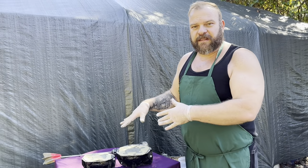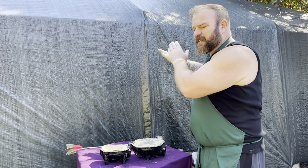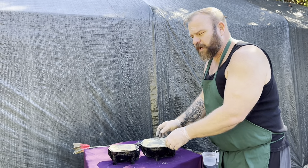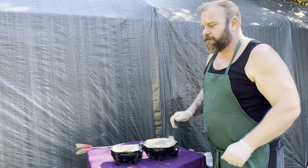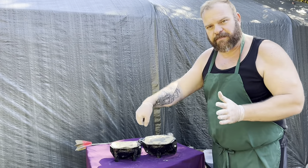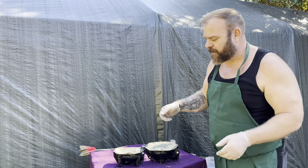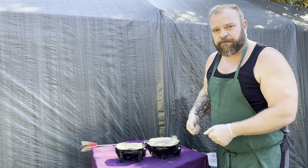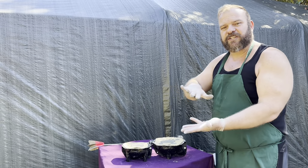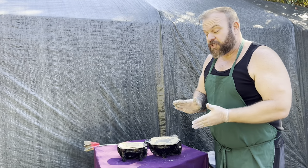When I do something like this I'll have dozens of molds, so I do a bigger batch. By the time I'm done filling the last mold I can usually come back and do the last quick vibration, get the water off, and go through them all. At that point I come back with a flat paint scraper or trowel and smooth out the bottom — real easy, real quick. You want to make sure it's nice and smooth, flat, and level on the bottom so when you take the statue out it's going to sit level and not wobble.